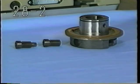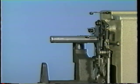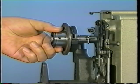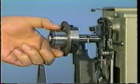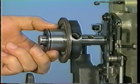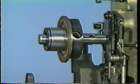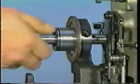28.2. Assembling the pedal pressure decreasing device. Attach the stop-motion cam to the main shaft. Fit screws number 1 in the screw holes in the cam through to the holes of the main shaft, and secure the stop-motion cam by tightening screws number 1.